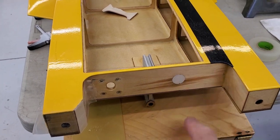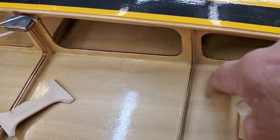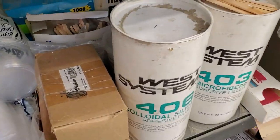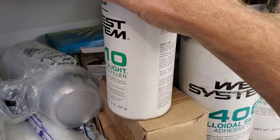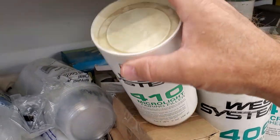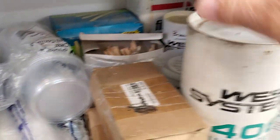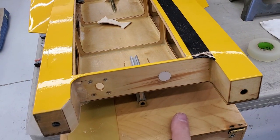When I color the epoxy right, I can get pretty close to the color of the wood. The fillets you see in here have all been colored. It's a filler — West Systems 410, a very light filler. That's why I call it micro-light, and it's slightly brown in color, so it gives you a little bit of a wood color. It's real handy for making pretty little fillets that aren't so visible. I meant to go darker here, but it didn't turn out.